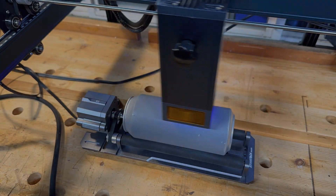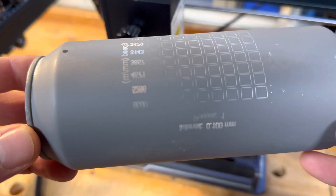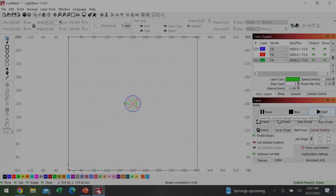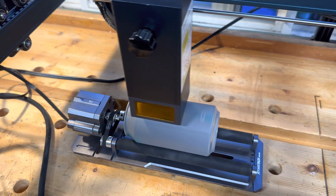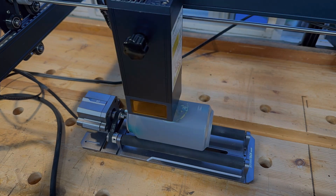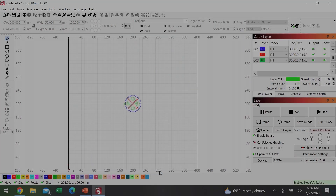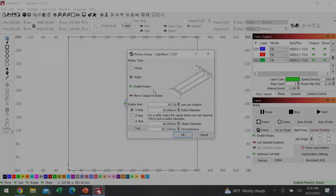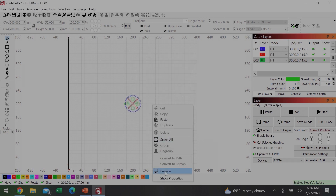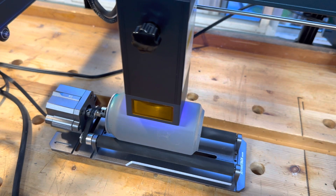The materials test went about how I expected, although I noticed one weird thing — the test pattern engraved as a mirror image from what was on my screen. To show what was going on, I did a simple engraving of my logo, and my graphic was indeed coming out as a reverse image. I checked the laser preview, which wasn't reversed, so I went back to rotary setup and noticed a button — mirror output to rotary. I turned that on, checked the preview again, and this time the image showed reversed, so I sent it to the engraver. Now my engraving came out the right way.